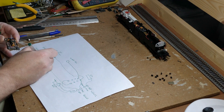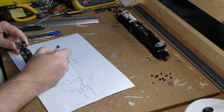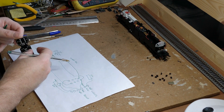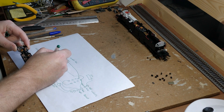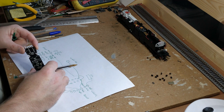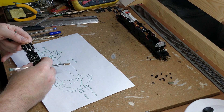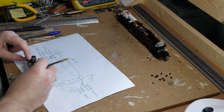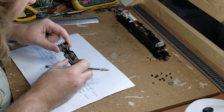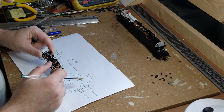When working out what a PCB like this does, remember to look on both sides of the board. Also look for places where one side connects to the other — as well as a dedicated via connection, this can also be where a component leg is. It's not uncommon to have a trace leading away from a component on both sides of the board. Also look out for traces that go between the two legs of a component without touching either — this is really common too.